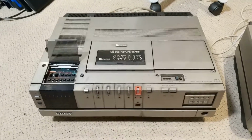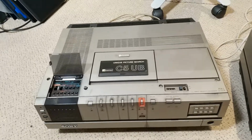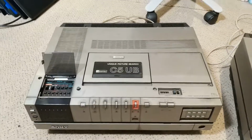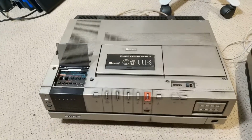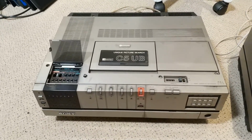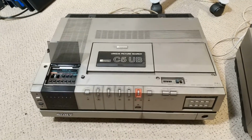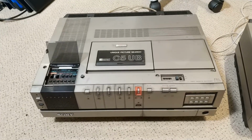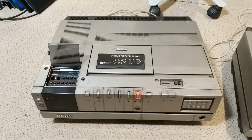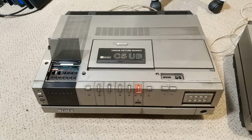As soon as I get one of these in, the first thing I do is change those capacitors, and they are always leaky, and there's always a lot of leakage as well. Once they short across, that's it. So yeah, I do quite like these. Good, solid, reliable machines, relatively, for their age. So what we'll do is we'll power it up and see what happens, I suppose.